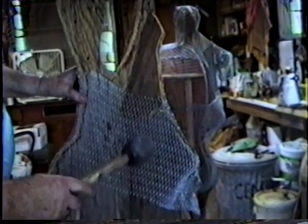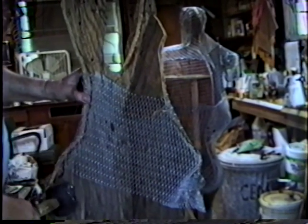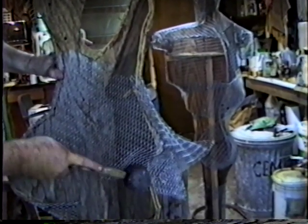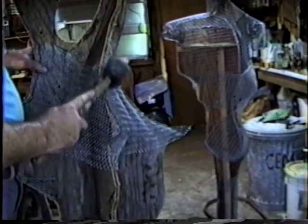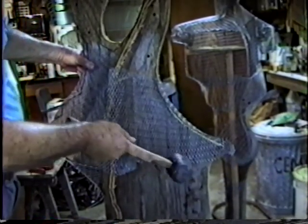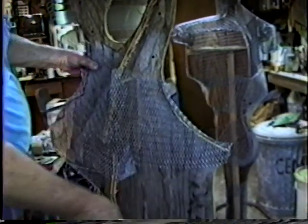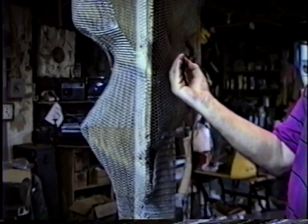Get just any kind of a tool. Concavity, you can just beat it in and the lath stretches. So it is very, very forgiving. If you want to get in this more, you can deal with that. You can really sculpt the lath quite sensitively with just a hammer or a stick or whatever you happen to have. You can just split this up with a tin snip, beat it back in, and slip another piece right in and make a hollow right there if you wished.